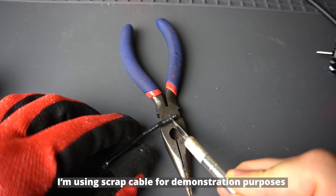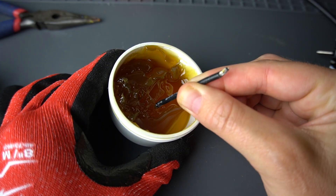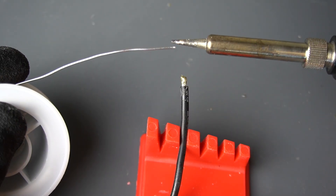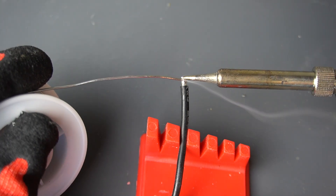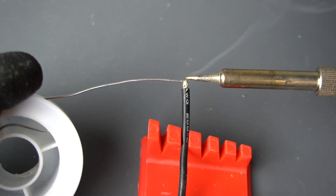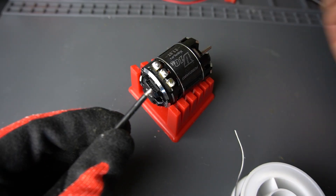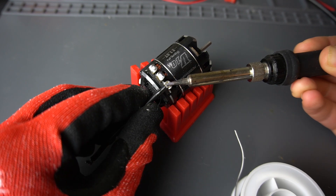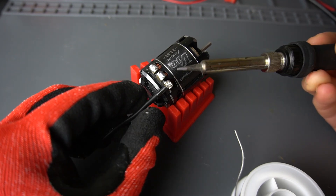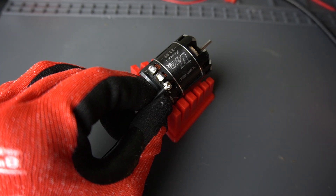The terminals should look nice and smooth on the surface. Next, let's prep and pre-tin our cables. Remove a little bit of wire insulation using some wire strippers or a hobby blade, being careful not to go too deep. Dip the cable into flux and secure it in place. Add solder to the tip of the iron, hold it onto the cable, and feed in a little bit of solder from the spool, allowing it to melt into the cable on all sides. You may need to rotate the cable to make sure it is fully coated. Now we're ready to make the connection — with a gloved hand, hold the cable onto the motor terminal, applying pressure from the iron and holding it in place. Once it's set, feed a little more solder onto the connection and let it cool, then repeat for each of the other cables.